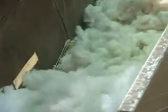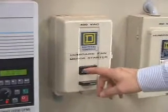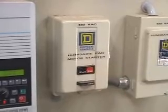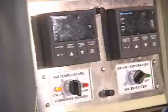Before attempting to gin cotton, turn off the water pump and let the warm, dry air from the unit evaporate any condensation that might make the lint stick to machinery. This should only take a few minutes. When starting up the gin, the Humidaire fan and burner should be the first thing turned on. This will allow more time to warm the machinery and help keep condensation minimized.